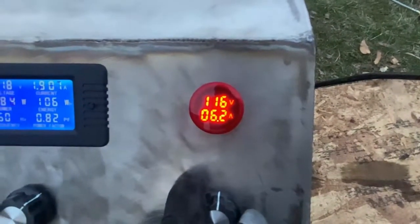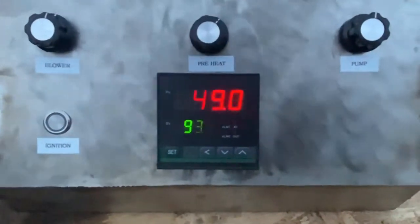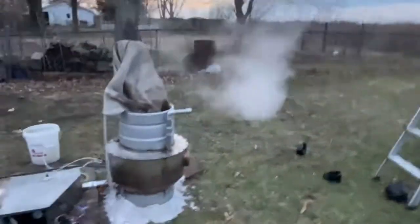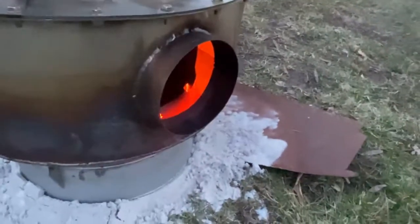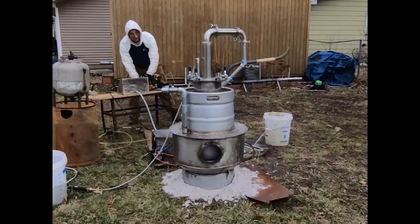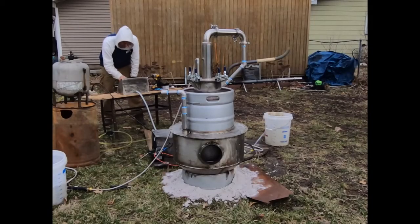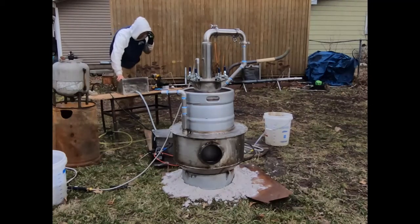The fuel's way too high. Here is one of the first successful ignition procedures I did. If we start off with just propane — high propane and low air — and we then ease into the air and let this thing preheat for a while, lighting it up like that doesn't make any noise. You don't have any pops or backfires. If you do it too lean, you might get a little bit of popping and reverberation. So we just go with high propane, low air on the initial ignition, and that's pretty safe.